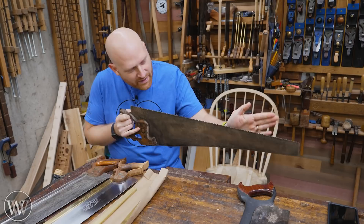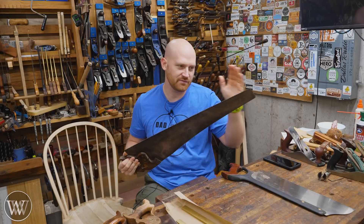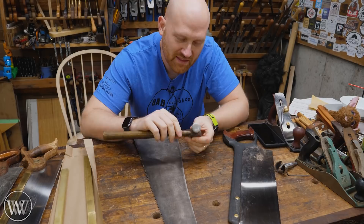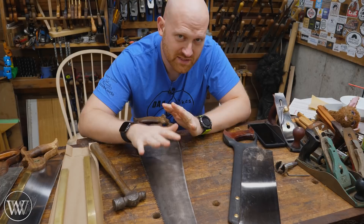But that's a gradual bend. What happens if it's kinked — if there's a point that it's bent rather than just a bend over a certain distance? A kink in a saw might be the end of the saw's life. That's one of the few things that can really hurt a saw. If the kink is right up by the tip, you can just cut it off and make the saw a little bit shorter. But if it's in the middle of the saw, it's really hard to fix. If you don't know what you're doing, you probably have about a 50-50 chance of fixing it, and the other 50 is just completely destroying the saw. If it's a collectible saw, you might want to leave it as is or find someone who has experience with it.